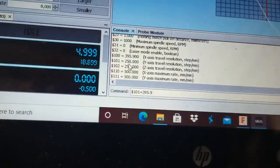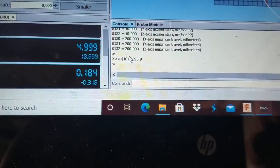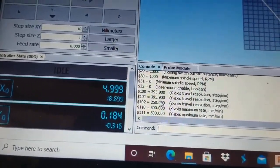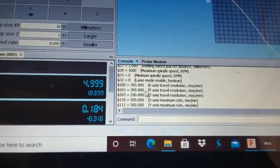I'm not sure if we use end-of-block or not, we'll just try Enter. There you go. Now if we put $$ again we'll see what it's updated to — 395.9 — so the same. That's sort of how you do it: make a movement, check it, and then change that figure.